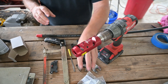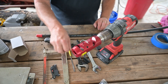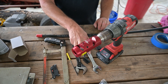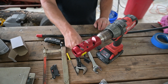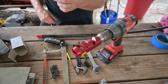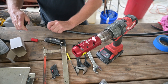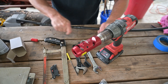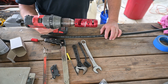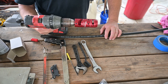We'll talk about what tools we're going to need here. We're going to need a hacksaw. I do have a razor blade to open our packaging. I have a small file, and a couple of wrenches for our connector — it's 19mm, so I have a 19mm and a crescent wrench. I have a small nylon bristle brush, a piece of heat shrink. And I've got my power rotary cable prep tool, which makes this a heck of a lot easier than trying to do it with a hacksaw and razor blades and things of that nature.